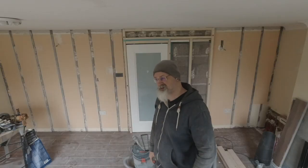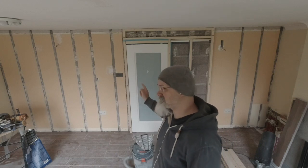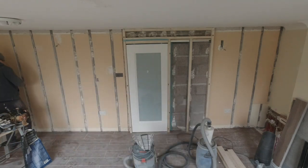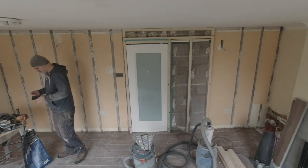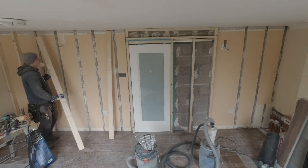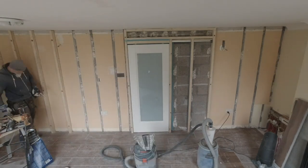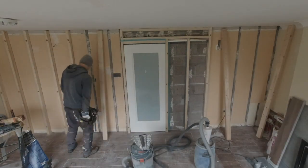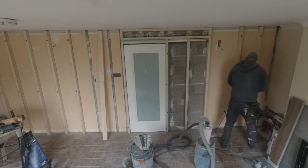Time to crack on with the studs. Because the ceiling is wavy and uneven, each of their heights needs to be measured individually. I have pre-drilled the studs. I now slot these into the grooves that I made for them, transfer the holes onto the block wall, then pre-drill the wall where I just marked. After that, the studs slot back in, and I can now fix them in with concrete bolts.